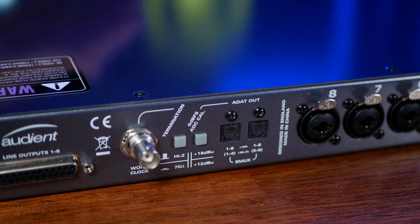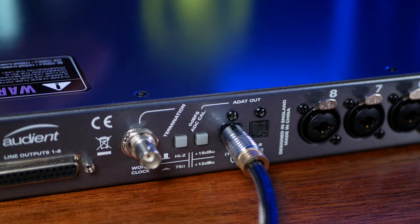At the other end, with our mic preamp, we're going to be connecting to the ADAT output. Now there may be more than one ADAT output on your particular device — that's to do with having different numbers of channels at different sample rates. But for the purposes of this exercise, we are going to be using just the left-hand one on the ASP800. So we're all connected up, but we do need to adjust some settings with our software.